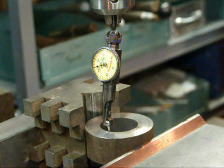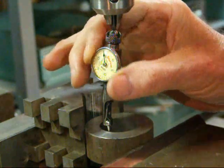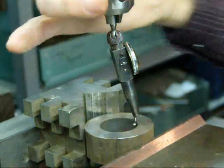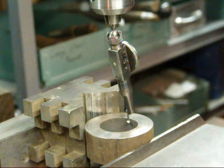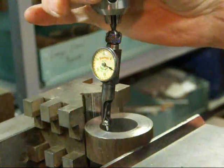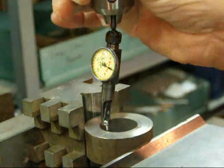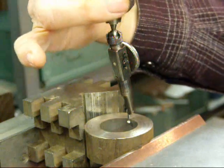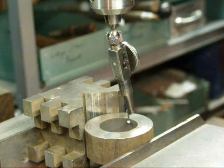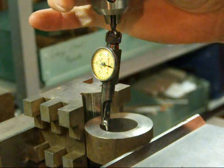So now I'm going to move the table — this is the x-axis, this is the y-axis — and we're going to move that to zero. I'm going to rotate it 90 degrees and I'm within 10 thousandths right now. I keep zeroing that out. And we're very close there, within 4 thousandths right now. So I always go half that amount. I'm turning the dial back to zero and I'm bringing it around to the other side and I'm within one thousandth there.